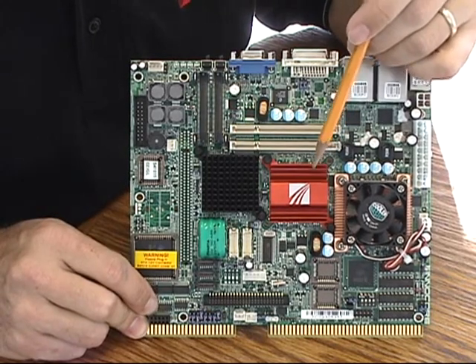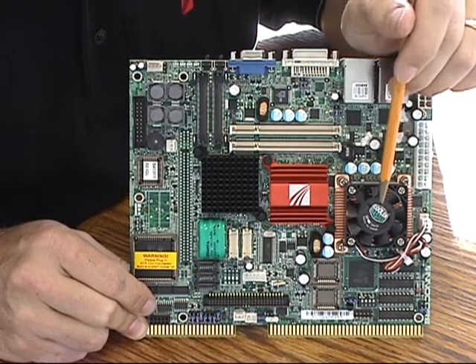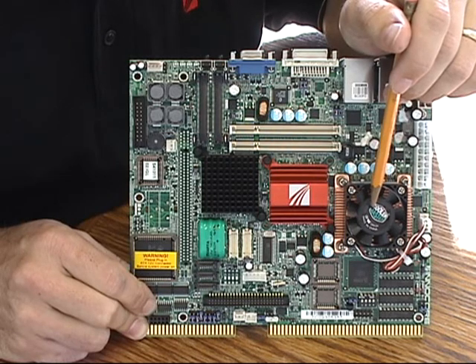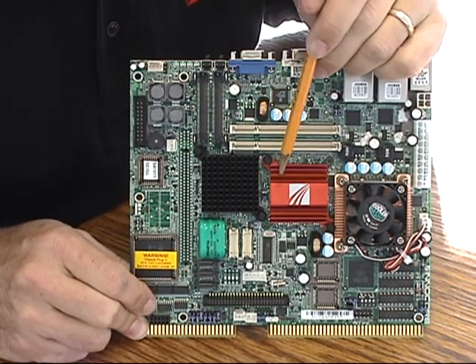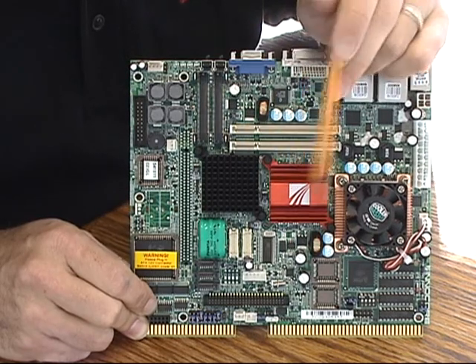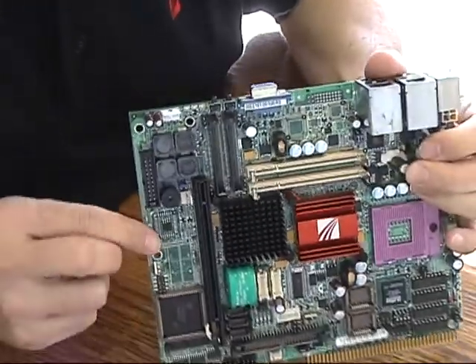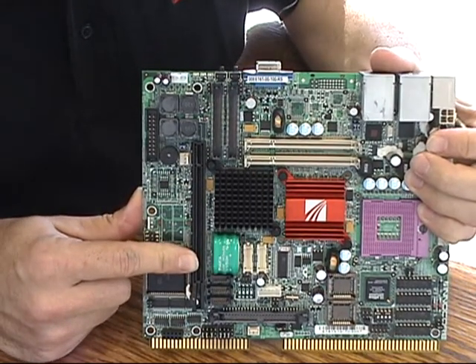The chipset itself is the Intel GME965, which is a 7-year long availability chipset from Intel. The companion CPUs are Core 2 Duo and Celeron M, with quite a wide range of CPUs for a very wide range of price and performance to suit any need. The chipset includes an integrated graphics core, the GMA3100 from Intel. There are two versions of the DPX-S410: the SDVO version which only supports integrated graphics, and a second version with a PCI Express full x16 bandwidth graphics card slot so you can fit standard graphics cards.